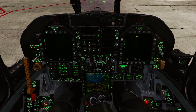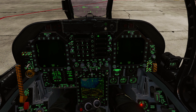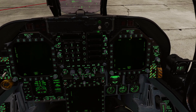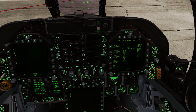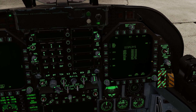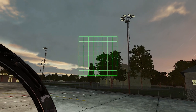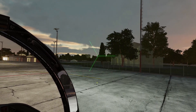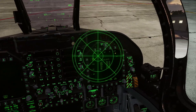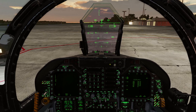You need to turn that on before you do the test. On any of these displays you can do the test — press the bottom middle button to cycle between the support page and the tac page. We're going to use the right display. Go to the support page, click on the top middle button, and we can see 'displays not ready.' Click on that and we've got 'HMD PBIT — go.' So you're going to press HMD right there and it's going to start flashing in test, cycling through all the symbologies. When you see the grid come around one more time, come down here and press stop. Done — HMD go, done. That is part one of the HMD online and test complete.